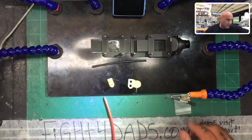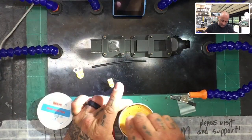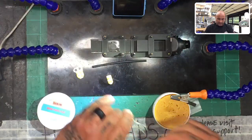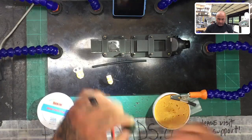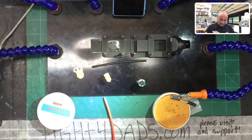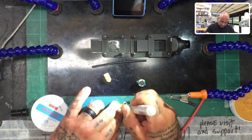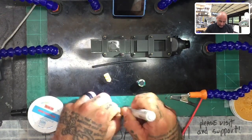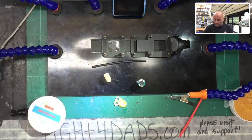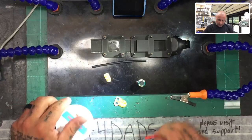First thing you want to do is tin the capacitor. Let me go ahead and just kind of soak that solder up and spread it across here quickly. There's that, and then we're going to go ahead and use our flux pen and get our stuff covered. I'll do both sides to make sure it's covered all the way around. Flux pen is done.